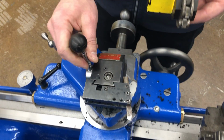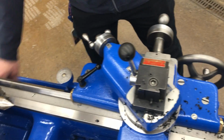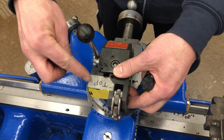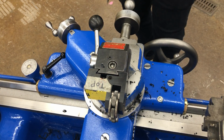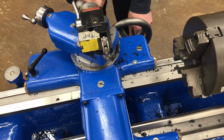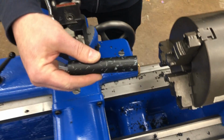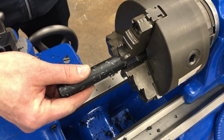And to switch it out with your cutting tool, once again, you lift your handle straight up, this slides out, leave it in your tray, and then you can slide this in, the top faces up, and then clamp it down. I'm gonna back this out pretty far. And then I'm gonna set up my cylinder. I might hold a quarter of an inch.